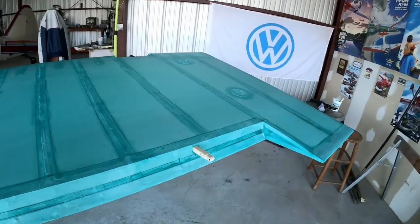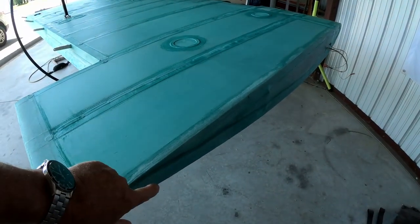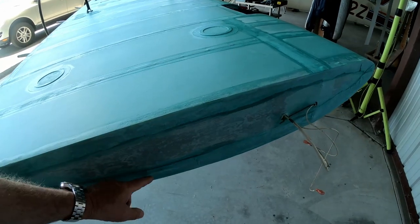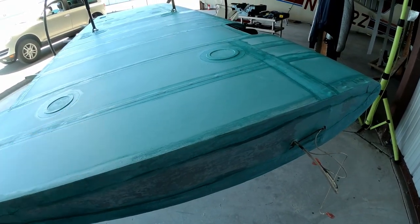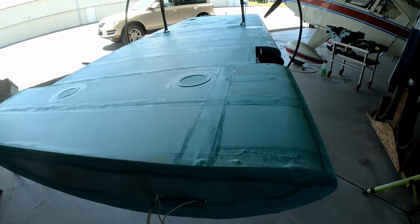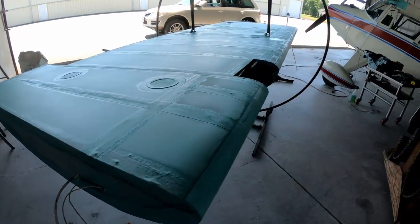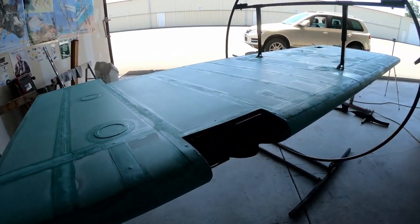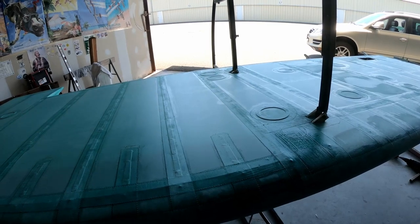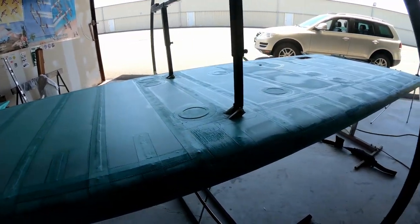So I'm getting ready now to work on the wingtip. First I need to put 3 cross coats of the UV block on, just on the rib here basically, as far as the wingtip will actually cover when it's screwed on, and then I can put the wingtip on. That's about the last thing other than fitting the aileron, to make sure that the cables are coming out in the spot where I put the holes, and then I'm ready to move the wing home.